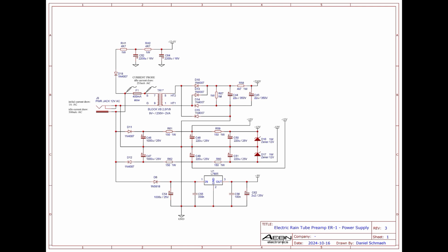All transformers have winding resistance that causes a voltage drop. A standard transformer has about a 3 to 5% voltage drop caused by winding resistance at full load. Transformer designers compensate the winding ratios to account for the voltage drop. When a transformer is backfed, the compensated winding ratio will work against the user. Not only does the 3 to 5% voltage drop occur, the compensated winding ratio also adds a 3 to 5% voltage drop. As a result, backfed transformers can have a 6 to 10% voltage drop at full load.